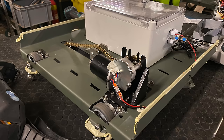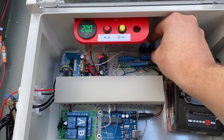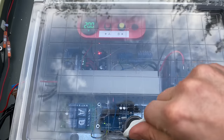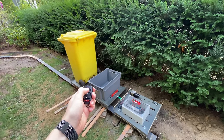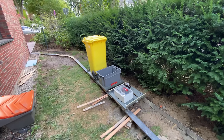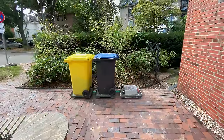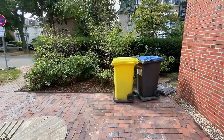This is the locomotive — at least the first version. It's just a windshield wiper motor and some chain drive, driving two wheels for two-wheel drive. For electronics it's an Arduino, a motor controller, and two potentiometers that change the acceleration and speed for troubleshooting. Then there's this remote, a cheap one for about 20 euros, and that worked surprisingly well straight away.